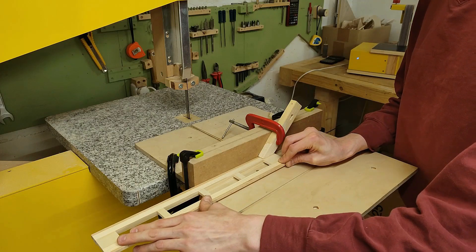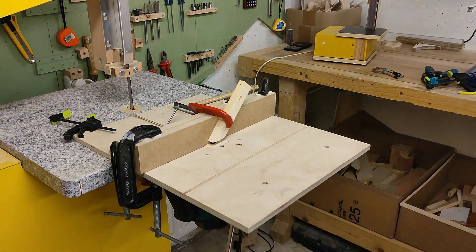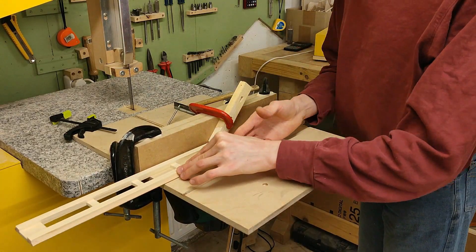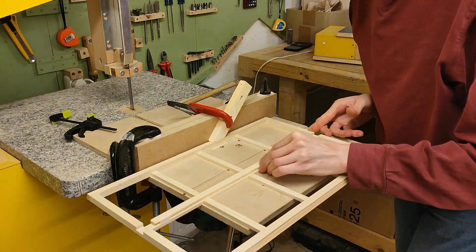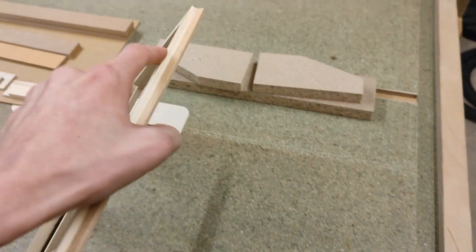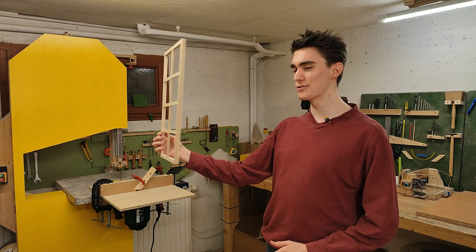The actual 45-degree guide surfaces are done on the router table — or rather makeshift router table, as I haven't yet built a proper one. Here it's extremely important to do a smooth and consistent final pass to leave the guide surfaces without ripples for the rollers to catch on. That's why I clamped one of these wooden springs to the fence, doing shallow cuts and carefully edging towards the real deal to get some practice feeding the material through the router smoothly. And the linear rails are done — we now have these wonderful hardwood rails on all sides for the v-groove rollers to roll on. I almost ruined it going too deep, because these clamps are not enough to secure the fence against vibrations. Technically I knew that already, but thought I could get away with it — unfortunately, I couldn't.